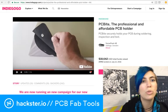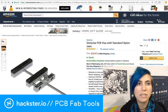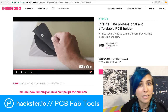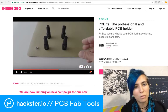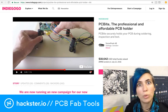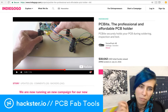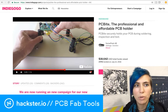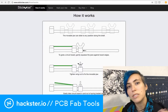The interesting thing about these two different options — the stick vise and the PCBite — is that one of them is very flat on the table and the other is more elevated in the air. I personally prefer something that's a little bit off the table, because otherwise I find myself totally hunching over. This only gives you a couple inches of lift, but I'm more comfortable soldering that way. Other people may prefer a wrist pad and the table-mounted solution of the stick vise.